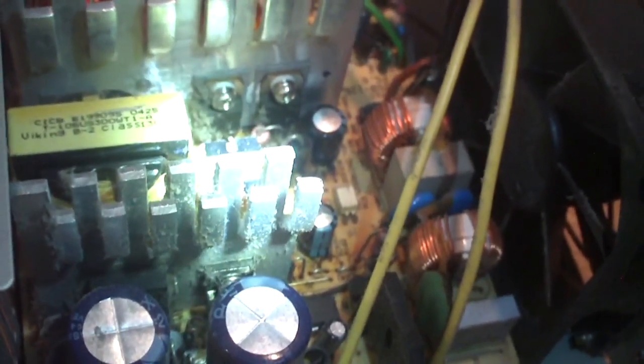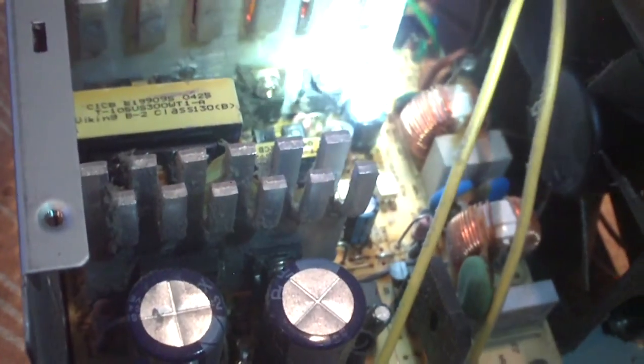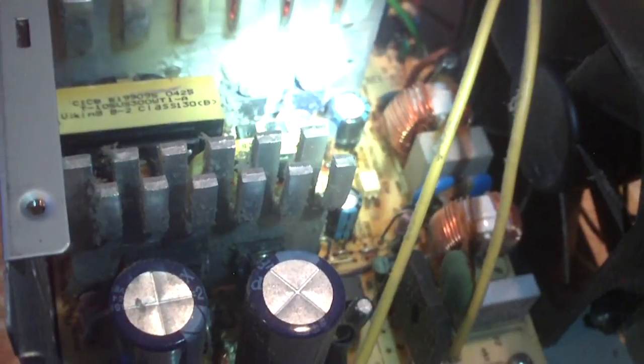Factors such as load can vary this number. I actually have a video on YouTube of me plugging in one of these with a multimeter hooked up to the 5 volt standby rail — I got almost 13 volts out of this thing before it slowly trickled down to about 7 or 8 volts. So this answers the question of what goes wrong with the 250 12E power supply.